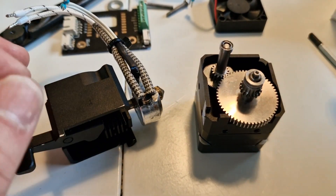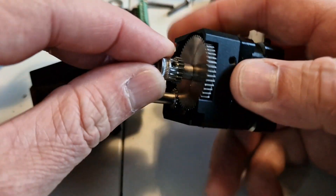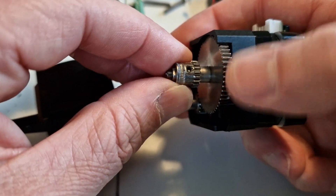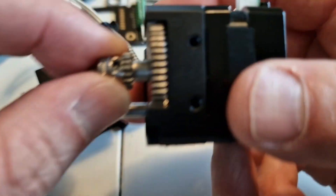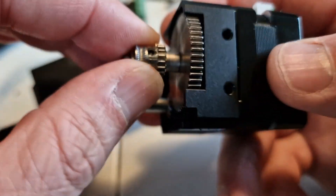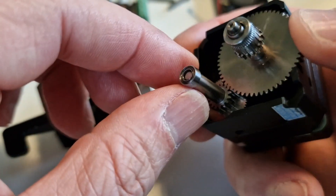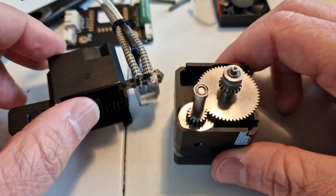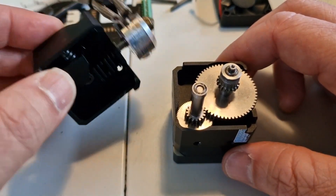There's a lot of talk on the internet about sloppy gears and problems where basically you have this backlash — this clicking noise that happens a lot with the thumb gear. With retractions it's really noisy. You get that while it's put together and it seems like sloppy gears, things not meshing up right. A lot of people in the 3D community have been complaining about it and basically just leaving it to poor quality.